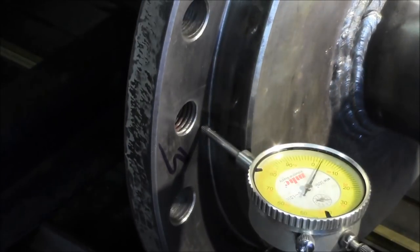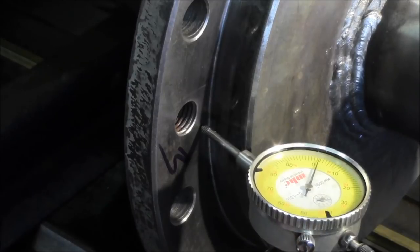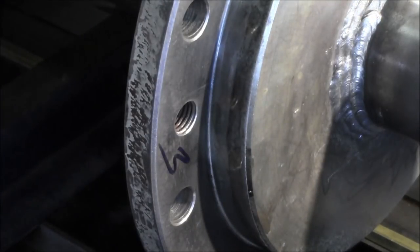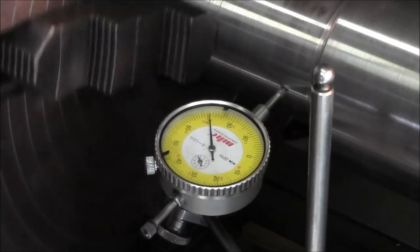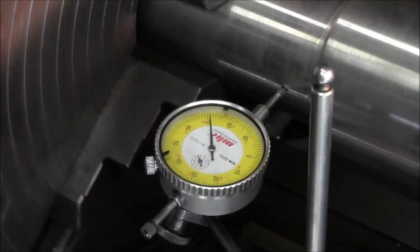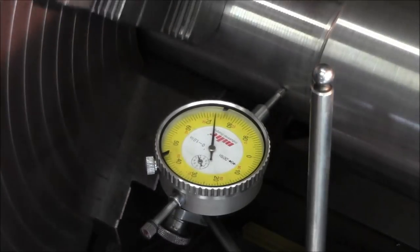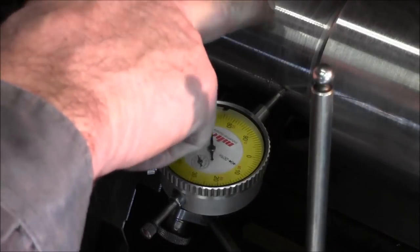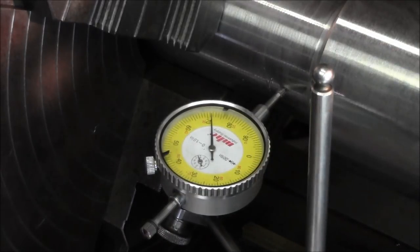I'm going to live with one-half thousandth fluctuation — it's only in one spot. I mean we were pushing half to three-quarters of a thousandth over and that was it. I didn't really expect it to make too much difference. Now let's go back up to the chuck and see how much it took to dial this in. That little waviness you see in there is because of the harmonics at that cut range — but everything is all roughed out. We're going to machine that in to run true with that register, and then we'll get ready to machine.